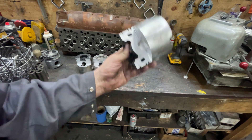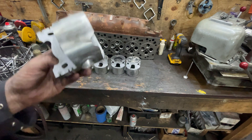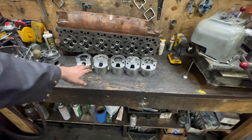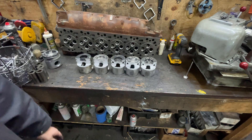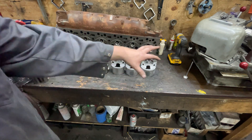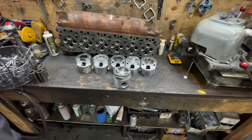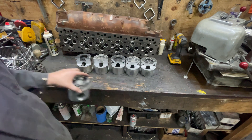That's another reason I like the common rail platform — running common rail pistons in a 12-valve. Because you can run crazy EGTs in it and it doesn't come unglued. Whereas with this bowl design, when you get it hot, it takes longer to cool off. So if you're pulling a big hill and retaining heat, these pistons last way longer — as long as you don't have an injection failure. But if you have an injection failure, that's not the piston's fault. There's never a scenario where that's the piston's fault — it's the driver or an injector, or both.